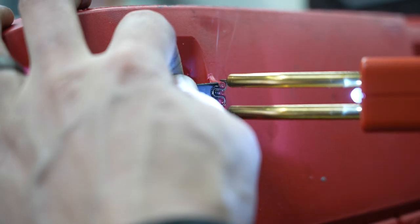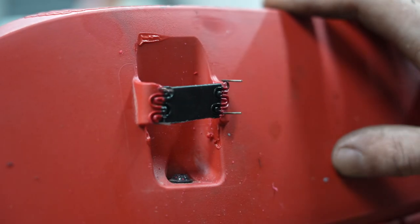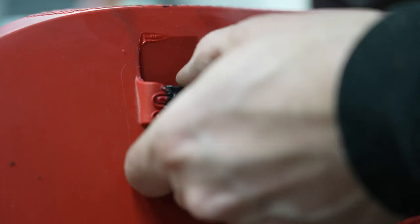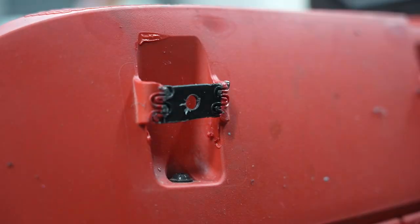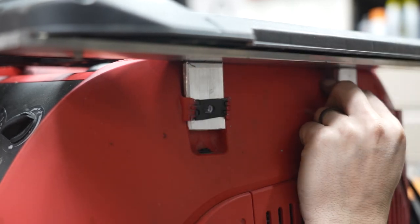Basically it's a little heat-charged metal clip that gets red hot through induction — essentially by shorting it out inside that little soldering-iron-looking thing — and then you jam it into the plastic. The plastic melts around it, and when it's all done you clip off the excess and grind it flush. This is the same sort of flexible plastic that I cut off the Packout plate, and it actually held up really well and is super strong. I don't love that it's the wrong color, but you're probably never going to notice it, so who cares. Anyway, this saved the project and allowed me to keep going.